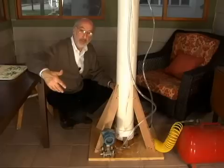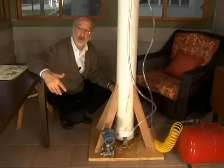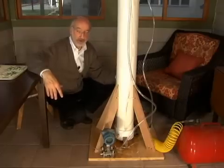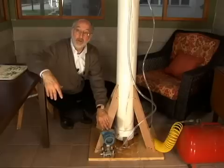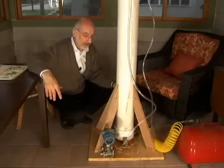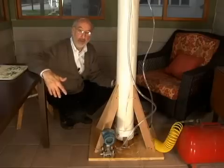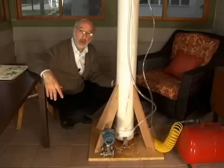It only works with liquids. You probably want to stay away from things where there is going to be sediment, because the sediment might have a tendency to clog the impulse line, or you just have to put the impulse line somewhere above the sediment level and compensate for it. If you are measuring something other than water — something heavier or lighter in density — you can compensate for that as well. You could do it using a mechanical gauge, even a mechanical differential pressure gauge if necessary. But if you are going to feed information to a larger control system or outfit alarms, an electronic device is going to help you a great deal, because you can send the information remotely, trigger alarms for high or low level, and any number of other things using this approach.